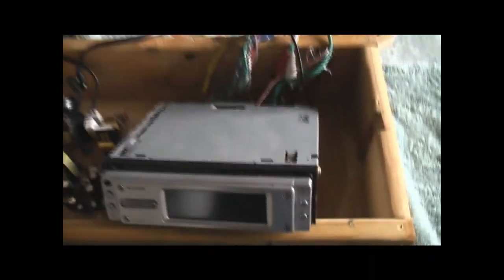I'm using a switch mode power supply from an old DVD player — 12 volt. It's got that little rail connector with positive 5 and all that, but I'm only using the 12 volt 5 amp rail for the head unit. I'll set the power supply there to fit in the front — it should all fit together in the box.